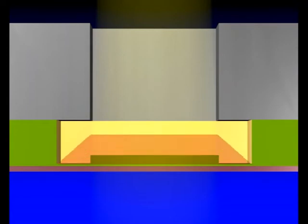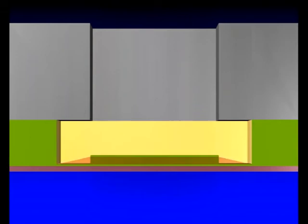Miniaturization may be achieved with an entirely different kind of absorber design. A very thin heat flow layer is arranged around the absorber. At the end of the heat flow section, the material thickens and thus acts as a heat sink. The entire layout may be produced in one piece and out of one material. The arrangement combines the absorber, the heat flow layer, and the integrated heat sink. Upon exposure to radiation, the thermal properties of the absorbing layer are particularly advantageous. Temperature is uniformly distributed across the absorber. Heat drain may be optimized by adjusting characteristics of the heat flow layer and is independent of the absorber surface area. The geometry of the absorber area is exactly defined. Such a bolometer may be miniaturized.